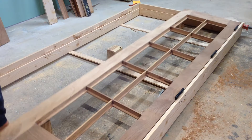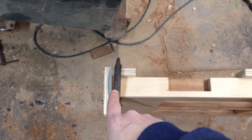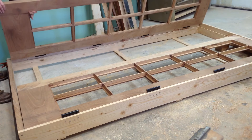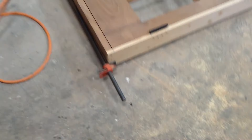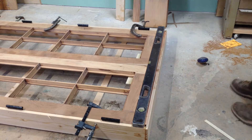The second door glued up a little out of square, so my fence was a little too small. I had some scrap shim pieces in the shop, so I put a shim on either end so I could fit it on the piece. Just make sure you shim both sides — if you only shim one side, it will be a little off. It was the exact same process for that side of the door, and I was really happy with how this turned out. The next part of this process is putting the reveal around where the two doors meet as well as the top and bottom, but that's outside the scope of this video — I just wanted this to be a video on how to do these hinges with the jig.